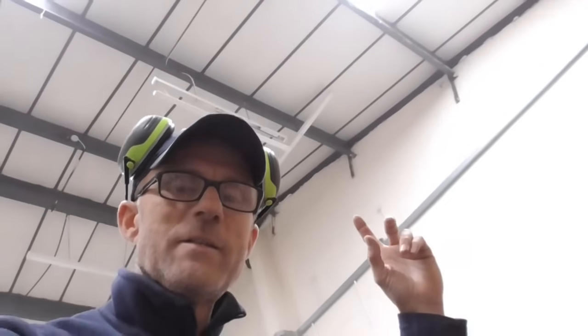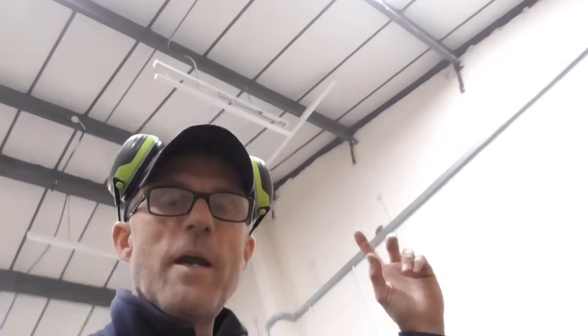So there you go, we've cracked on really well. Happy that those resin anchors are gonna get a nice good holding. And actually, this is a big gable flank. You can see these angle brackets that have been welded on these roof purlins, and that is to try and tie in this massive gable end. So there's not an awful lot holding that.